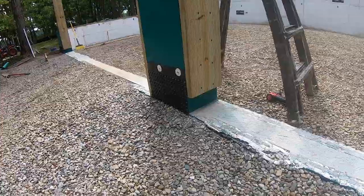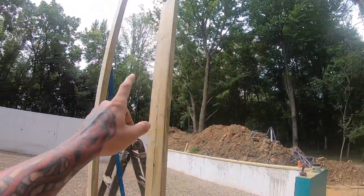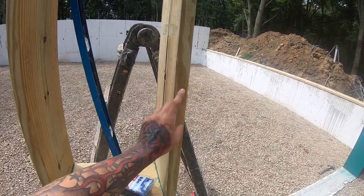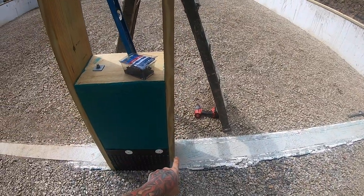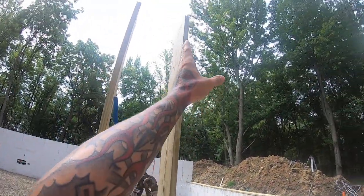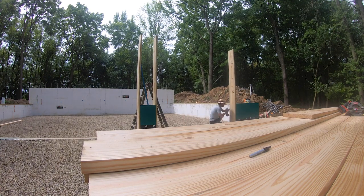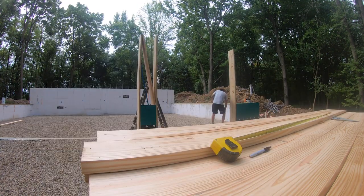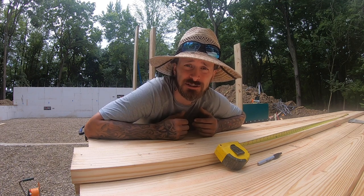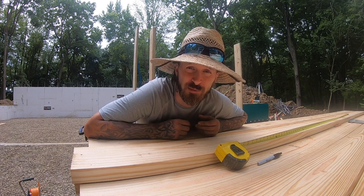Getting it up here and off the concrete but still having a concrete base to support the load - that's why I'm cutting back that five inches. When we hang these headers I am going to double plate it. Basically in here supporting load going up, we're going to do a jack stud - a king stud supporting all the weight from the header down to the foundation - and then a second reinforcement that goes up there and also supports the header. I'm definitely not screwing this entire garage together, so I went and got my portable compressor and framing nailer and we're going to start putting this whole thing up with nails.